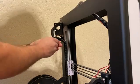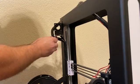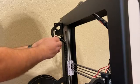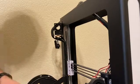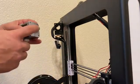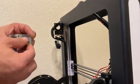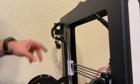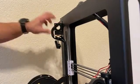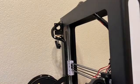If you don't want to use the filament runout sensor or if you don't have one, you can ignore my whole spiel about having to change the mount. Quite simply, the only other things you would have to do is remove the little set screw right there, pull the gear off, and then I'll show you how it all goes back together. I'm going to stop this right now, replace my mount, and once we get back to installing the new extruder I'll pick it up from there.